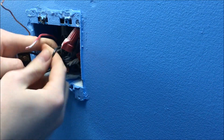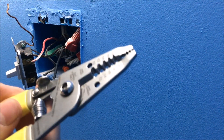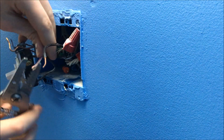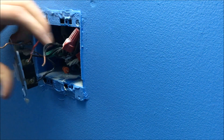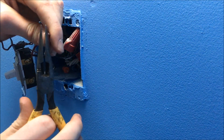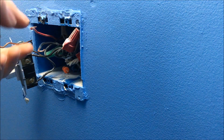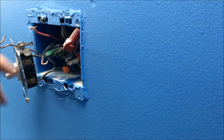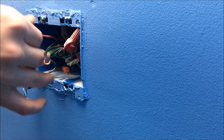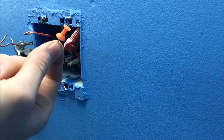The easier thing to do is to just leave these other wires alone. Now that I've cut them, I need to strip these back to a proper length and find the right gauge. Then take your needle nose pliers and put a curve into these. In my last electrical video I said it's normally just black, not white — I forgot to mention that sometimes there are red wires, which also indicate hot. Neutral wires are white.